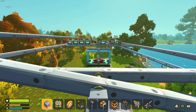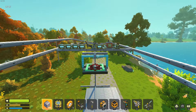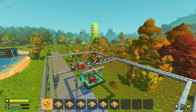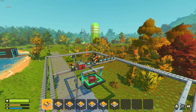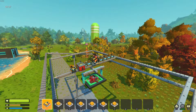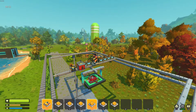Finally I think I have something to show you. Because it's actually opposite with the test rig — I'm moving the gyroscope, whereas whenever I build something I'm actually going to be moving the structure around the gyroscope. Everything has been sort of opposite and I kept doing it wrong; it really hurt my brain. Anyway, let's turn it on. I'm not too worried about the steering left and right because I'm going to manually want to steer my plane, so I've just got the steering there to simulate that it would at least fight me or correct itself. It'll only go so far and then stop. I need to adjust the angle of the sensors to get the tolerance a little bit closer so that the steering will center you back on zero. But this is just a proof of concept — it works.